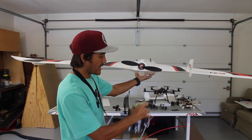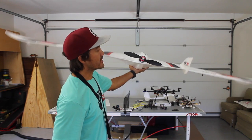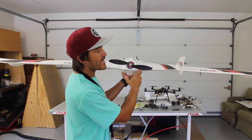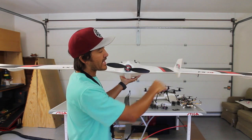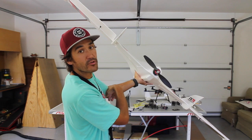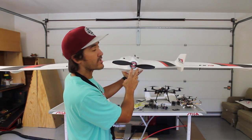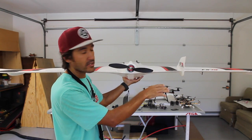Now I'm going to flip my switch and I'm actually in fly-by-wire A mode. What you expect to see is that when I roll the plane you'll see the control surfaces change automatically. If I pitch forward and back — this is all configured in Mission Planner in your radio calibration screen for Elevons. There are a few checkboxes you need to sort through, but the main thing you want to make certain of is that any movement you make — whether you roll to the right or left or pitch up or down — Pixhawk actually counters that movement. For example, if I'm going to roll right, you should see your left flap come up, which will ultimately cause the plane to come back to level. And if I pitch down, you'll notice that my flaps on both sides come up, which will ultimately bring the plane back to a level flight path. That configuration is in Mission Planner and there's the ability to reverse your channels individually or together.